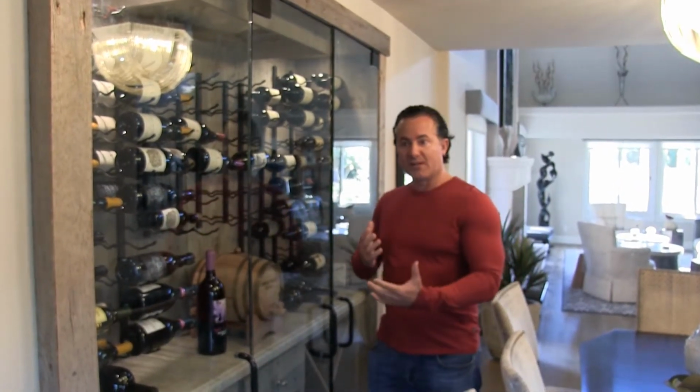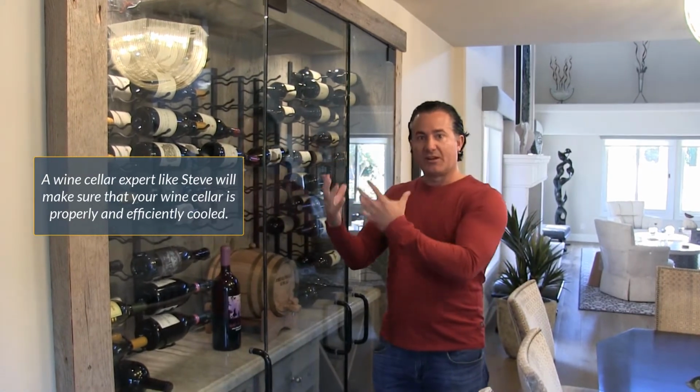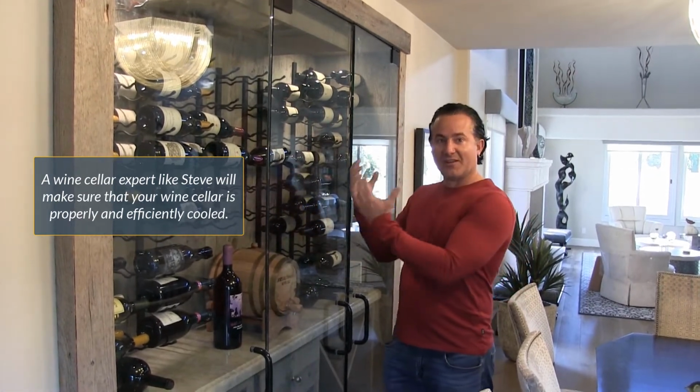And when we opened this up, we saw that you're supposed to have insulation. Well, they had the fiberglass insulation that you put in regular walls. They had no green board, no vapor barrier to protect from the heat and the cold coming in. And when you have an oversized unit, you're going to produce condensation, you're going to produce mold.